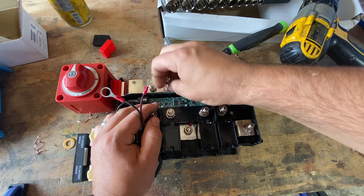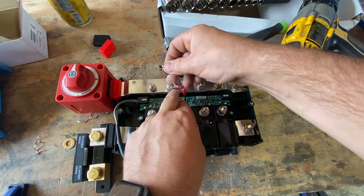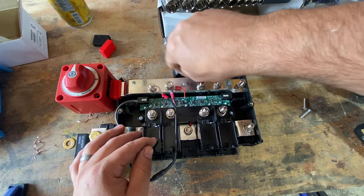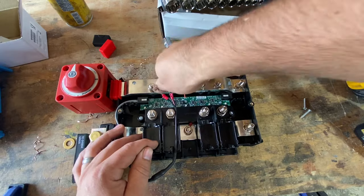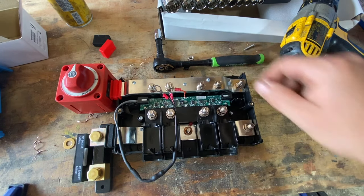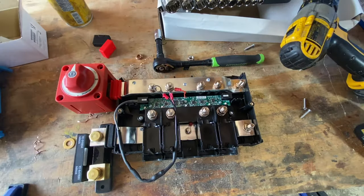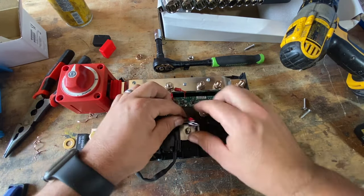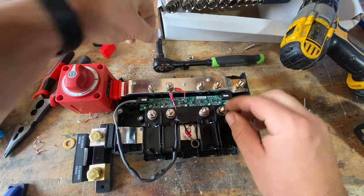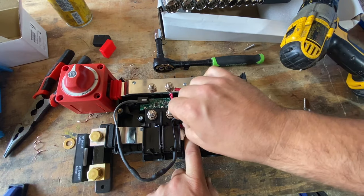I usually end up landing all my positives to one of these, and it ends up being this one most times. So, to get some of these out, I find a pliers like this works real good. Actually, that I don't have to worry about a whole lot. Usually we do the main ground on one of the lines. So this is basically just component ground for this little thing or whatever else I need to ground. Like the Cerbo GX, things like that.